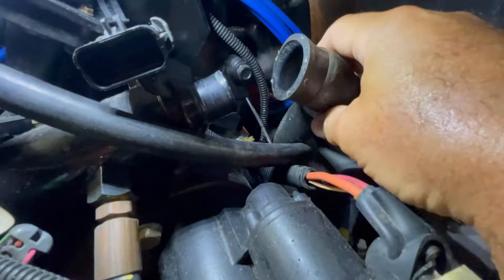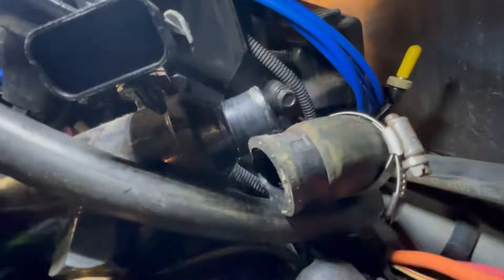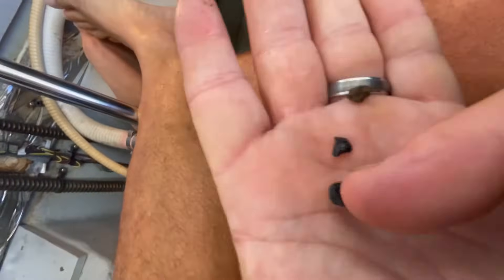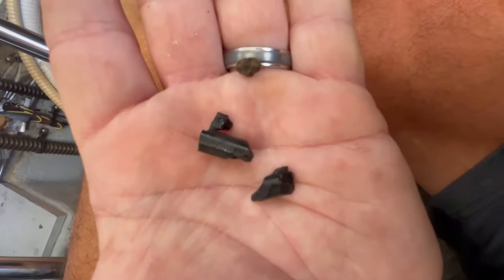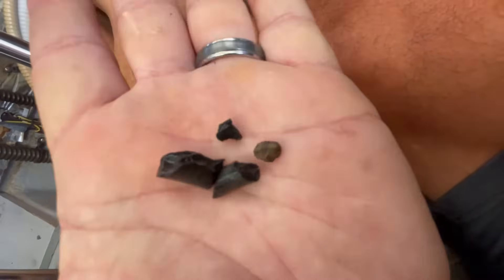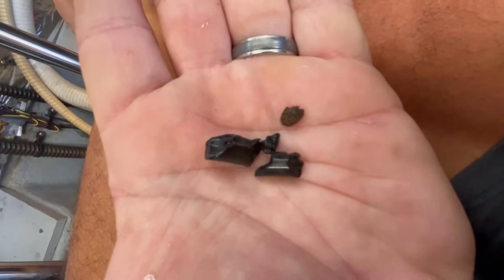I'm going to pull this off and you're going to have some raw water come out, so be ready for that. I put that off to the side — really can't see from this side myself so let's see what the camera shows. I dug my fingers into the end of that cooler and pulled out these three large pieces — those are pieces of an impeller from years past that broke off an old impeller, probably before I even had the boat. This is the first time I'm checking this, so we do have some evidence of blockage. We're going to flush it with water now and see if anything else comes out.